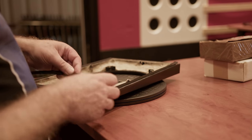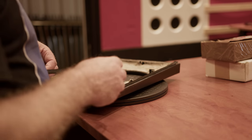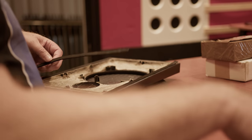Once complete, I placed the whole front baffle in a polythene bag and left it in a cool environment to slowly dry over a number of days. Once the cement had dried we had a very well-damped front baffle, so I reinstalled the drivers and sealing strips and fitted it back onto the rest of the cabinet. Here's a before and after clip for you.